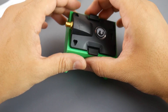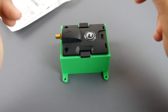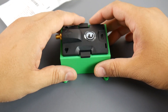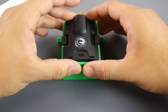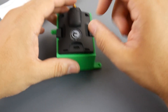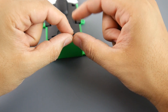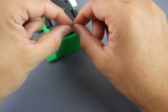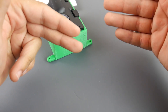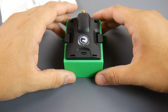I am really loving my new 3D printer, the Creality CR10 Mini - I'll have it linked below. This thing is print-and-forget. After assembly, just level the bed once, and then each time you boot it up just do minor leveling adjustments - it doesn't even take three minutes - then start printing and let it go. I just made a mod to print flexible filament and it's been flawless. The main calibration issue is the extrusion multiplier: with flexible filament the gears compress it, so if you tell it to extrude 10mm you might only get 3mm. You have to set the right multiplier to get accurate extrusion.